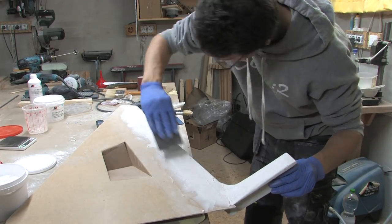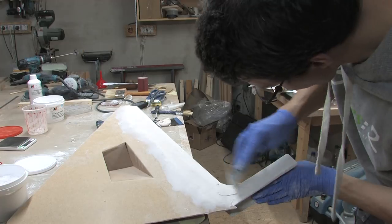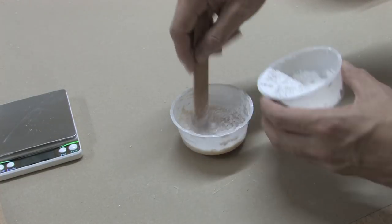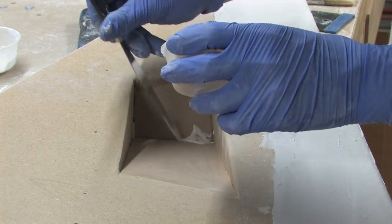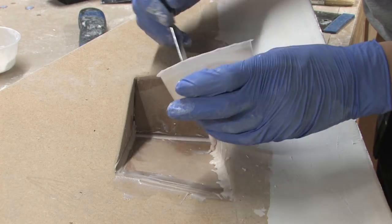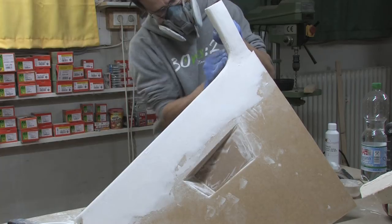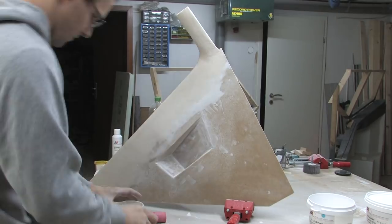After a first sanding, I flattened the surface with a coat of mixture reinforced by the ATP powder. By adding a little bit of Thixotrope B, I came out with a mix that could be used as a light filler. After the next sanding session, I applied the next coat with the roller.